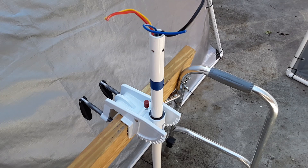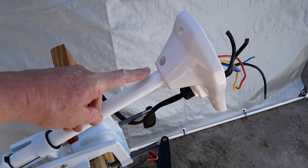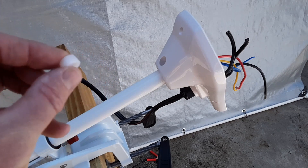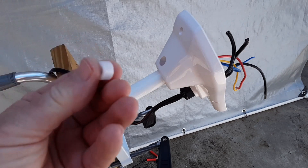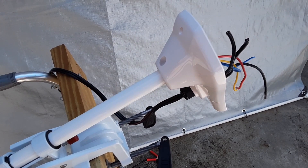There are plenty of videos on how to cut the shaft so I'll just show you how everything's ready for the rest of the project. One tip: make sure you drill a center hole through the back end of the base of the head unit. This is the little bushing that comes with it — just slide it right in there and then you can put your drill bit right through the center of that.